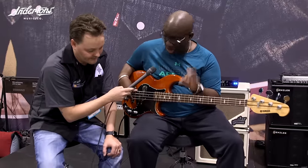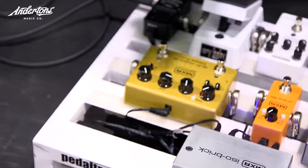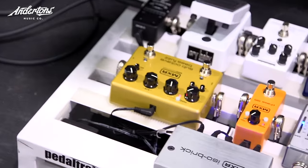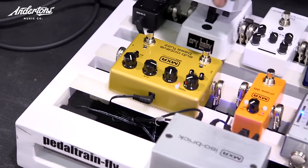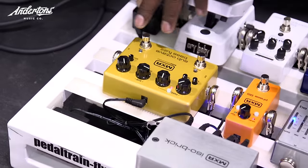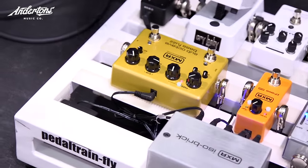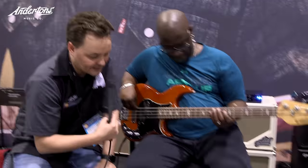So this year we have a new sub-octave bass fuzz. It's basically a dual-channel fuzz with a separate octave and a separate dry. Basically you have a gain that feeds into the fuzz circuit. There are two different circuits — one accentuates the higher frequencies, the other, the red fuzz, accentuates more the fundamental. In the fuzz channel you have a separate bass and treble EQ. Then you have your sub-octave with a separate footswitch, and then a dry channel. So it's almost like you have three pedals in one. You can mix the dry signal in as well.